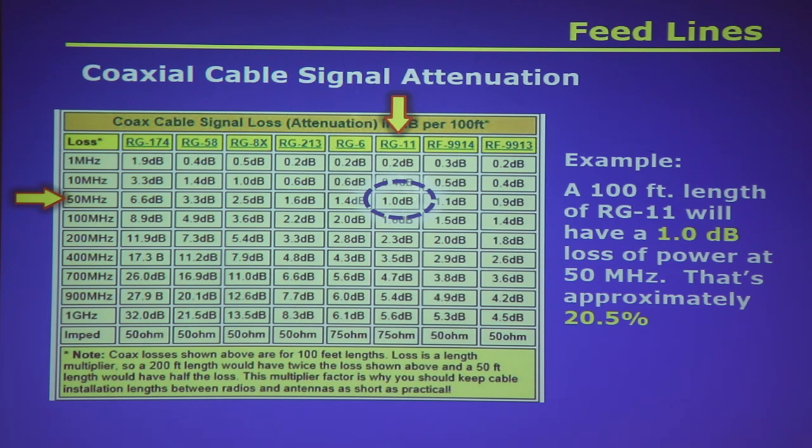If you're inside your house you can take a mag-mount antenna, stick it on top of your refrigerator, and it'll be 19 inches long — much better. Anytime you can connect your HT to a better antenna you're going to receive better and transmit better. A longer antenna like the Nagoya 771 is better, but the short rubber duck is convenient on your belt. It's the best you can do without impracticality.